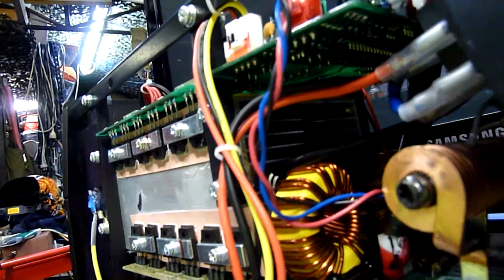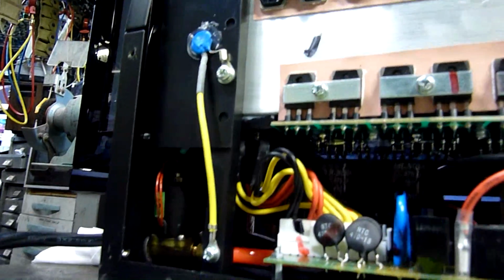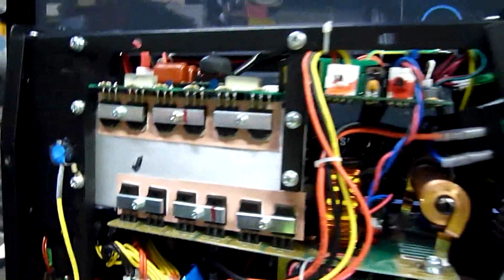Doesn't look like there's anything else inside. It's just a big pair of what look like Radio Shack off-the-shelf amplifier heatsinks. And these feed the bridge rectifiers up there. They look like 30 amp or 25 amp bridge rectifiers, 2 of them. Oh, and mains inputs here. Black and red are mains input to the thermistor and the giant MOV off the main switch. Yeah, pretty good.